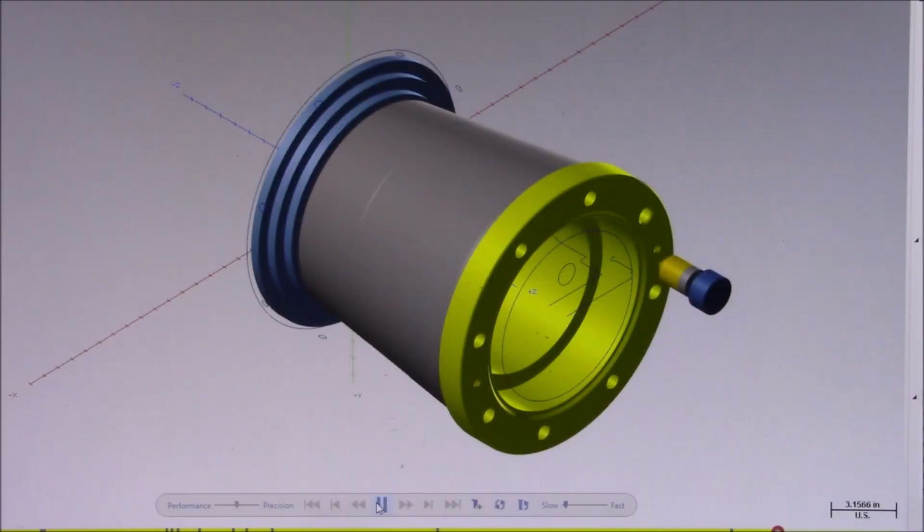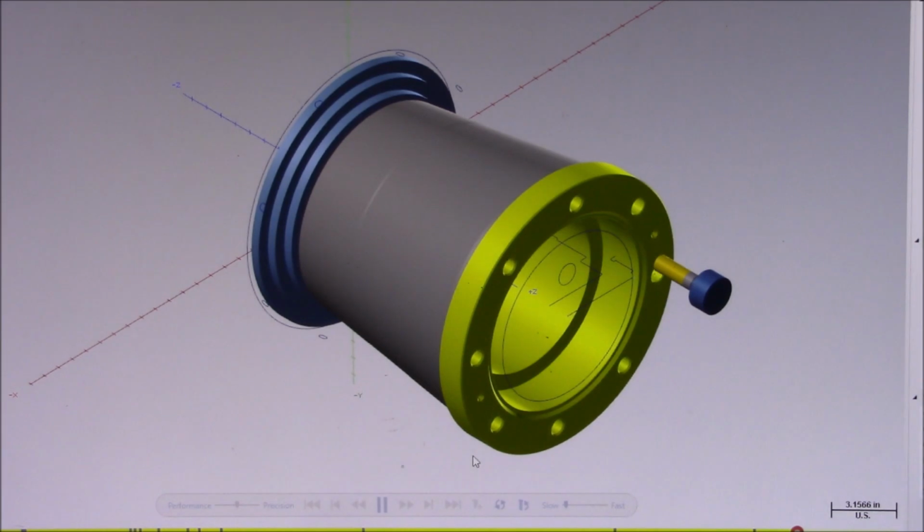The same 8 holes are now being given a 45-degree chamfer. It helps to deburr the holes and it looks more professional, but it also helps to guide the tap in during the tapping process. And now the holes are being tapped. These are blind holes with the threads only going in about 1.5 inches.